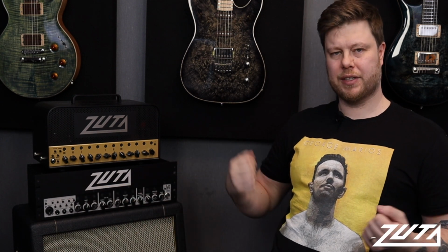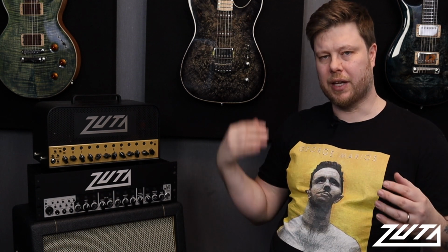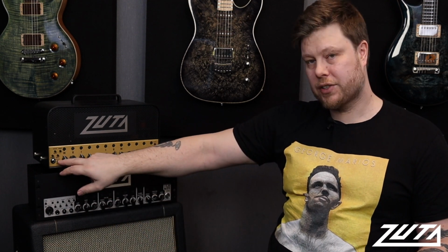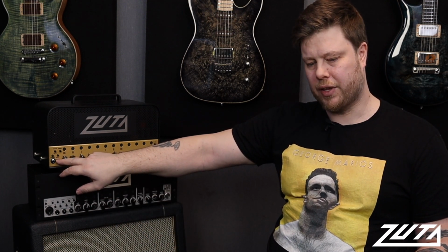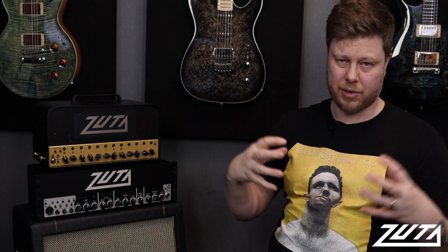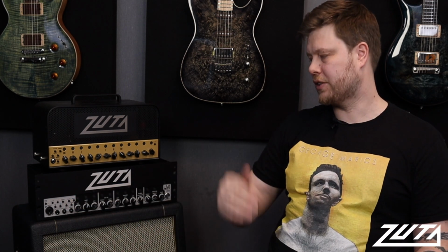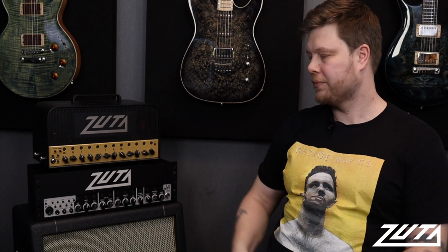And I think that explains better that it's sort of a compressor kind of thing. When this is deactivated, the amp is more compressed, saturated, sounds really good at lower volumes, a little bit more gain. But if you press the open switch in, it opens up, gets more headroom, more dynamics. So it's sort of reversed for this one. With Dynamics, you think the standard is open, and pressing it in activates a compression circuit. This is the reverse: the compressed sound is the normal, and activating Open opens the amp up and raises the volume a little bit. So they're mirror images of each other, I would say.